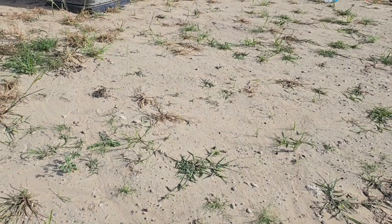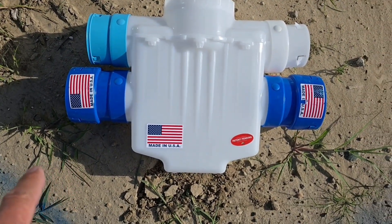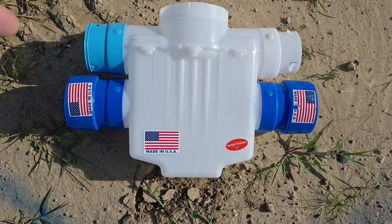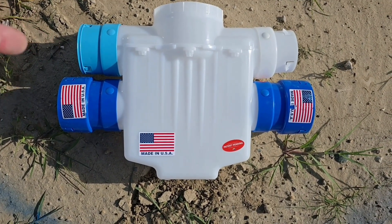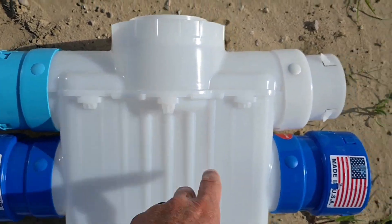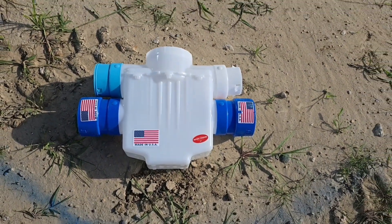We're going to use our four-way connect. We're going to have the blue solid pipe on the bottom in the four-inch, and we're going to have our three-and-a-half-inch coming off the downspout to the top connection point on this catch basin. We went ahead and capped off this side — we're going to be running these all the way around the house.